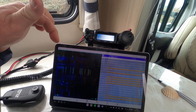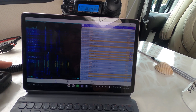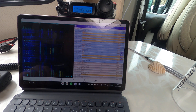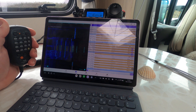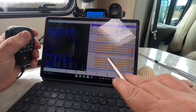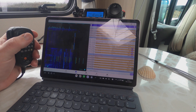I've got no physical connection between the Android tablet and the radio — it's literally just the audio coming out of the speaker into the microphone. When I want to transmit, I either key up the microphone or I can put the radio on VOX. Let's see if we can make an FT-8 contact with one of these stations. Maybe he's replied to me there — yes! Okay, so Argentina. There you go, one for the log book.